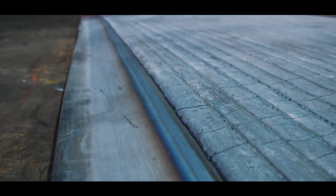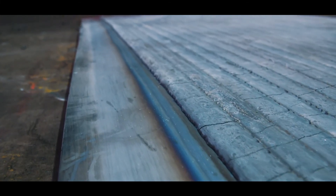The surface cracks are a normal occurrence. They are stress relief cracks that occur as the plate shrinks while it cools. The cracks do not travel into the base plate and therefore do not compromise the integrity of the material.